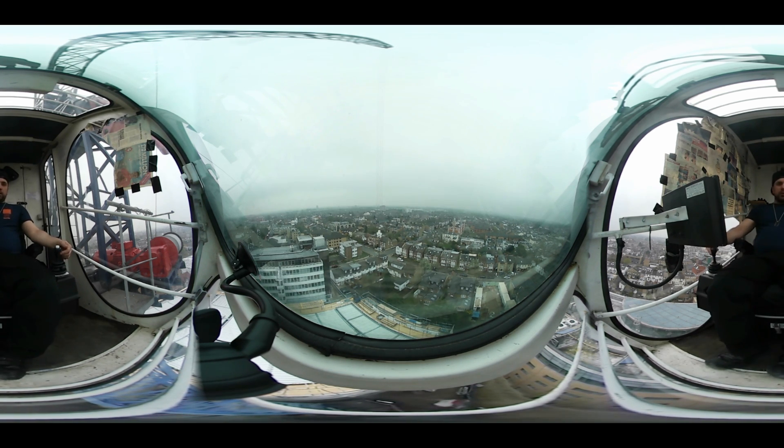This is a mechanical system so it clicks into it - you click first gear, click second gear, click third gear and so on. Normally it has about four gears on the hoist, and you have another three gears on the sleeve and about three gears on the jib as well. I'm going to hoist up now so I'm going in one click - there you go. If you look at the hook you'll see it coming very very slowly up. This gear you use normally to pick up a load, take the bite on the load, pick up the load.